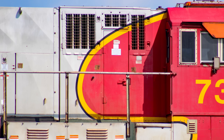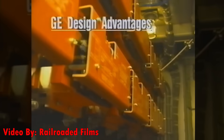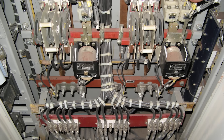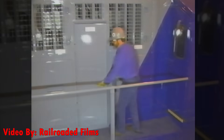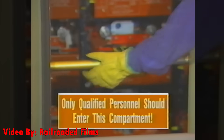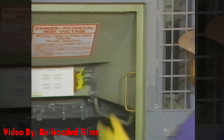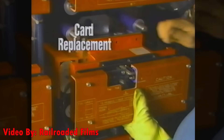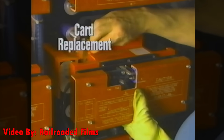Moving away from the prime mover, let's take a look at the AUX cab — the secret electrical room behind the cab of every locomotive that is only accessible through a hidden door. This place really isn't meant for people, so it's quite cramped, with a lot of very dangerous bus bars and live exposed electrical surfaces that could easily kill you. To combat this and ensure the safety of any electrician in there, there's either an automatic sensor or manual lever at the entrance of every AUX cab. These sensors and levers shut off all the locomotive's auxiliary power, so you don't accidentally kill yourself in there.